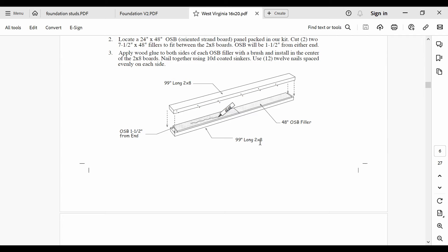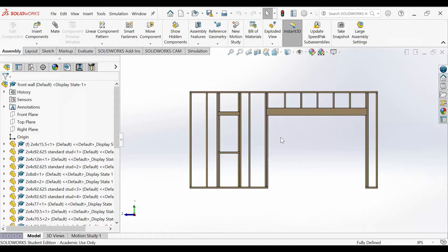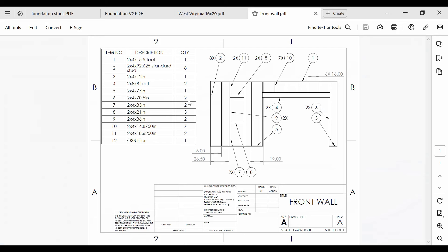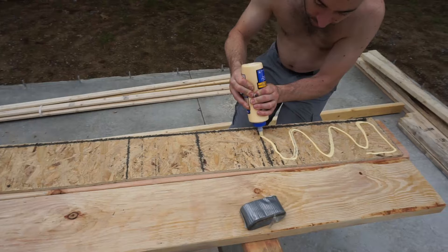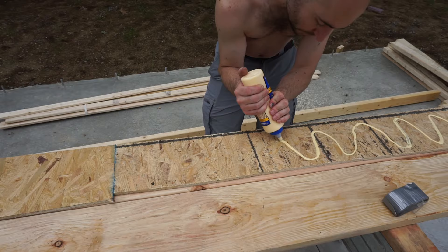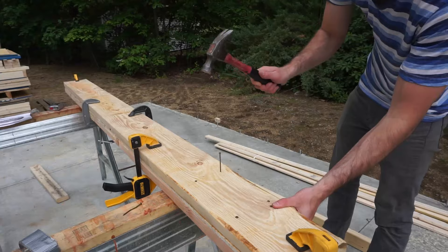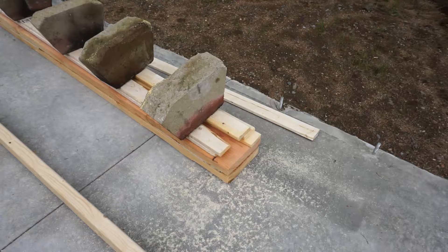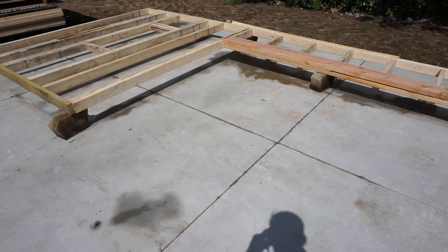Steps 3 and 5 are for assembling the front wall. The instructions don't always give exact dimensions because it's expected that you source your own garage door and window for the front. So I modeled the front wall in SolidWorks using the cutout dimensions specified for the garage door and window I picked out. This let me build a list of lumber cuts, which let me easily pre-cut all the parts and then assemble. For step 3, you have to assemble the garage door header, which is basically a stack of lumber and OSB glued and nailed together. This kit comes with a lot of glue, and trust me, we had to use all of it. The nails for this part have a specified nail pattern — we were careful to follow these patterns as they are likely specified for load-bearing reasons.